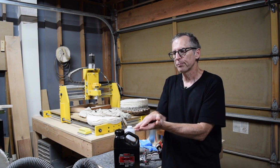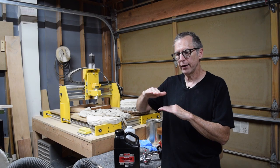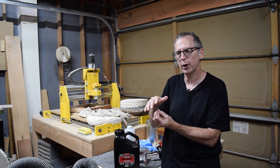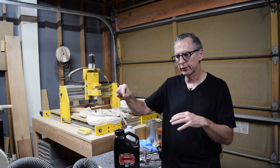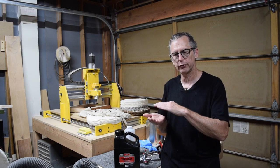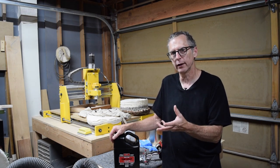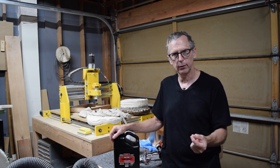As a result, when you level sand you're taking down that final coat, and sometimes the coats underneath will be exposed. If the surface is bumpy you're going to get little spots where you've exposed the underlying coat, and that causes a condition known as witness lines — and witness lines can be a real pain to deal with.